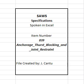7. The area of bearing in contact with solid ground shall be that as shown in the contract documents or as directed by the engineer. 8. All thrust blocking placed in conjunction with mains and appurtenances shall be in accordance with standard drawings DD 839 series. 9. In all cases, the design of thrust blocking shall be of sufficient size to withstand an assumed soil lateral load bearing capacity of 3,000 psf, unless specified otherwise in the contract documents.